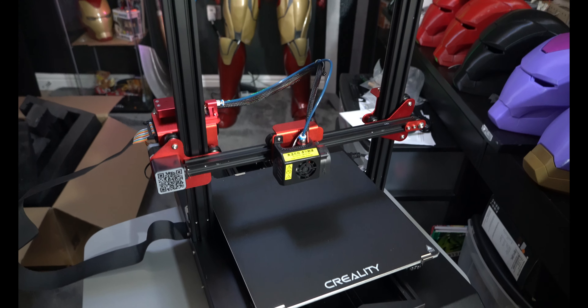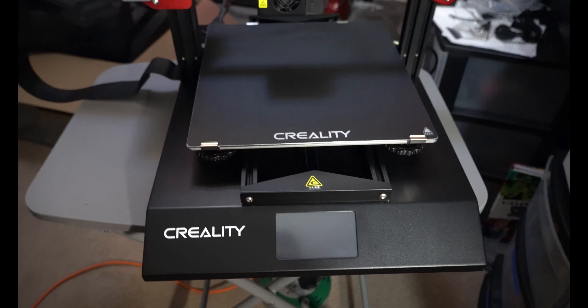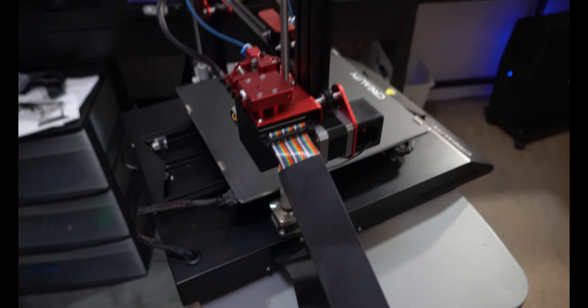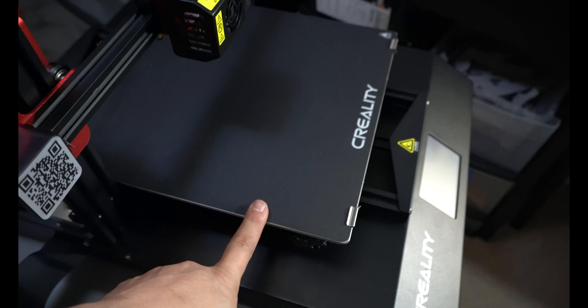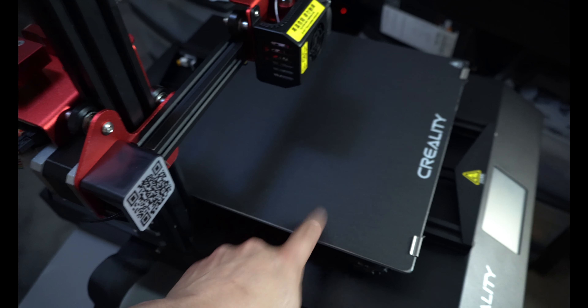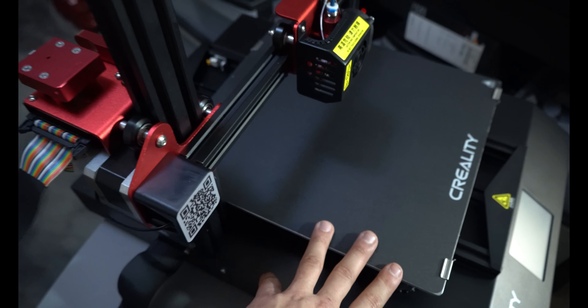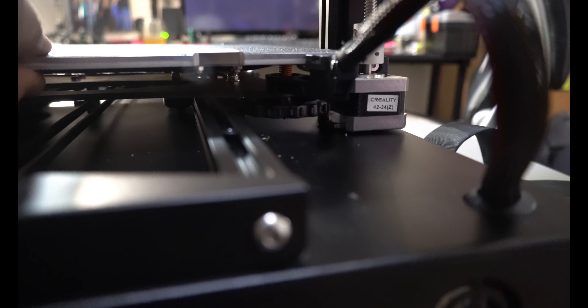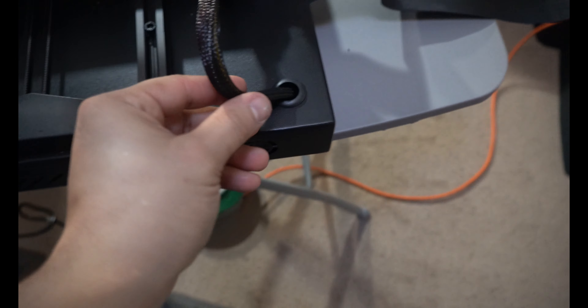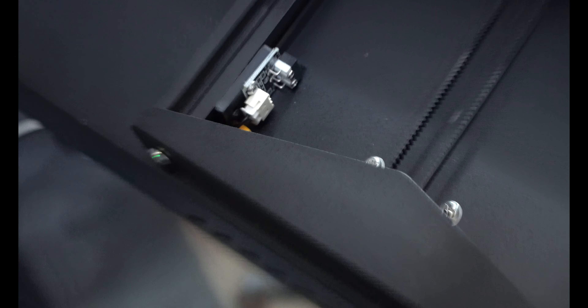Here is the printer — this thing looks absolutely great. There's really not too much to the build. A lot of it's already assembled, and that's why these pro models are a little bit more desirable. There's really nothing you're going to need to upgrade or change out. Now I might personally swap this bed out for the Creality glass ultra base bed, but for now this is absolutely a perfectly good bed. Make sure your wires for your Z steppers are actually tucked all the way in, or else the bed leveling nuts are going to collide with them. Make sure your Y stop is plugged in all the way.